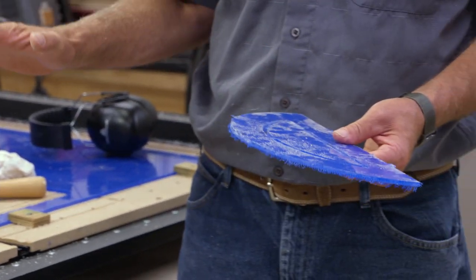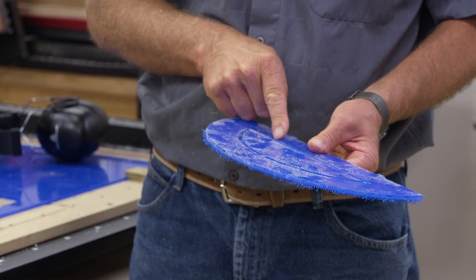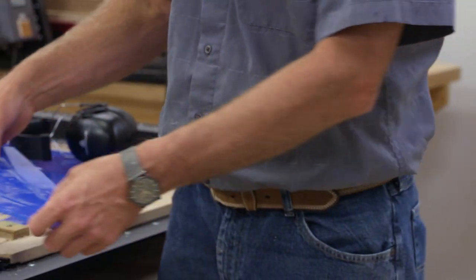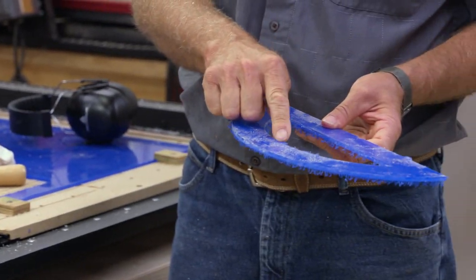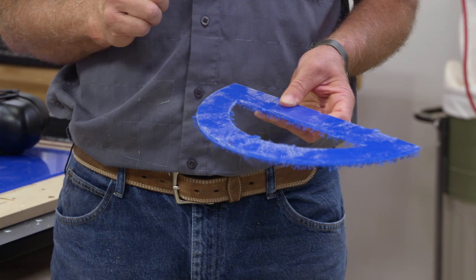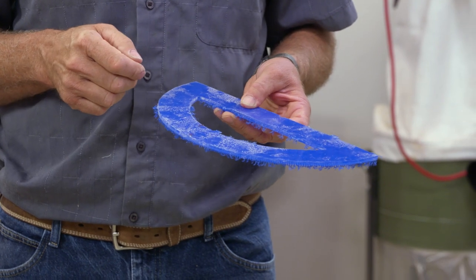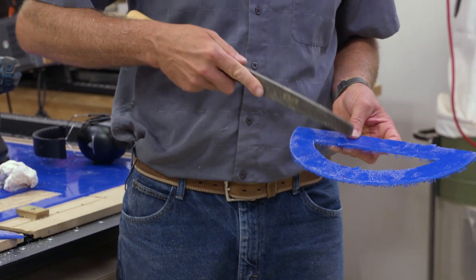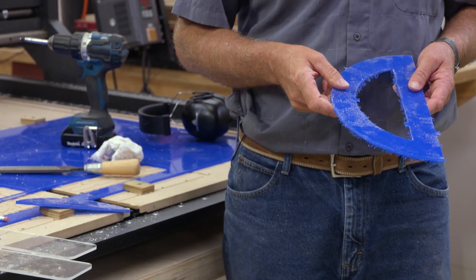Removing the tools from the plastic is pretty simple, but you need to make sure you don't fracture the plastic back into the tool itself. I have the tabs on top of this protractor at the moment and it's simple to break it off. To remove the tabs, you don't want to use any mechanical or power method like a belt sander, because that generates heat and that's bad news with plastic. The simplest and best thing is a coarse metal-cutting file — it takes those tabs off very quickly and easily. Well, that completes this set of tools.